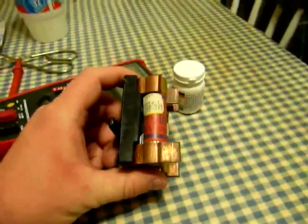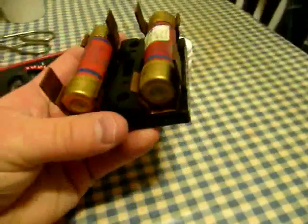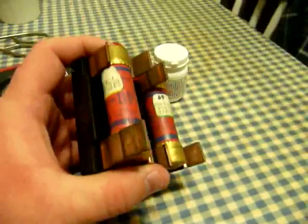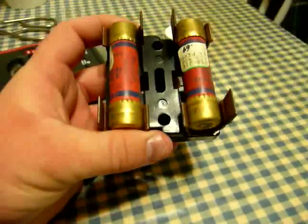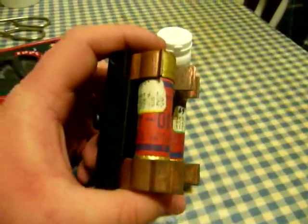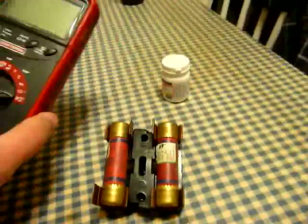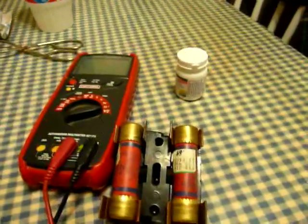Now, if you're going to work in your home's electricity panel, it behooves you to be very, very careful, because you can give yourself a nasty shock and hurt, burn, or kill yourself. And you don't want to do any of those things. With older electrical service equipment such as this, one thing you can run into is oxidation on the contact points that cause those contact points to heat up and become unable to deliver the proper rated amount of current. This can also cause the fuse to fail. These have been cleaned up at some point in the past, but it looks like they're getting a little oxidized again, so it's probably time to give them a second looking over with a wire brush or something. I'm also going to go ahead and test these with the ohmmeter.